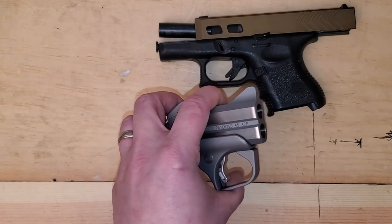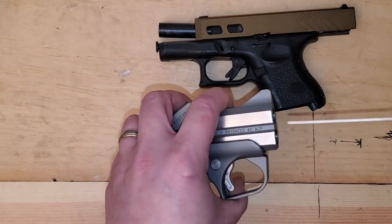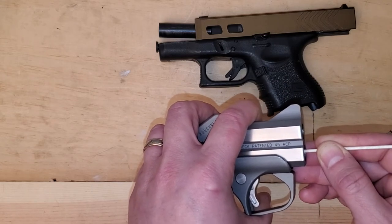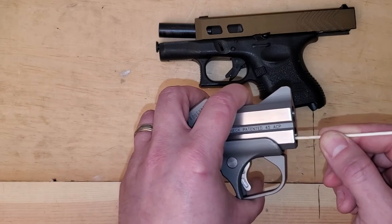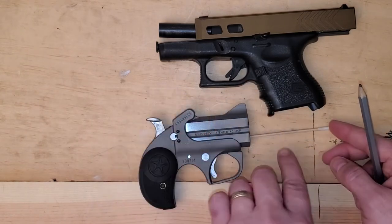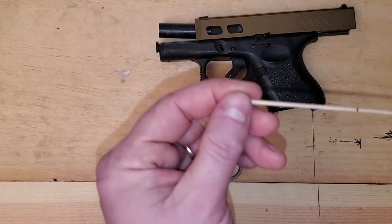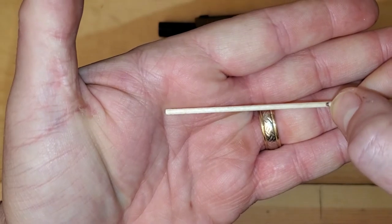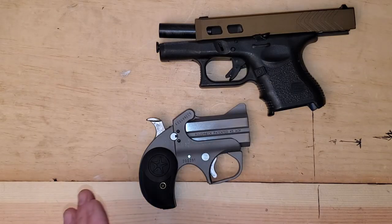Close the action. Typically you're going to put a solid object — a pencil would work, but ideally a dowel rod. A solid object. The way you do this is you put that object down and it has to touch the breech face. Or in the case of a bolt action rifle or semi-auto rifle, it has to touch the bolt face — the front of the bolt is the breech face. It has to touch where the firing pin protrudes from the firearm. Hold that there tight, and while you hold it there tight, you're going to make a mark flush with the bore. Then you measure from your mark to the end of that dowel rod — that is your barrel length. That is your legal barrel length. That is the way the ATF defines barrel length.